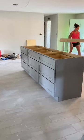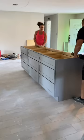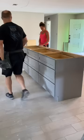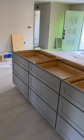We wanted the island to be a little wider than the standard 24 inch cabinet, so we decided to frame it out with 2x4s. We first added a 2x4 to the very top attaching it to all three cabinets, and then did the same thing by attaching a second 2x4 to the bottom. This will not only make the island a little wider but also keep those three cabinets secured together.